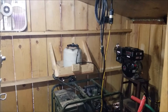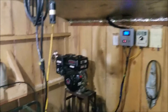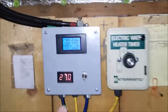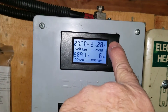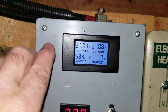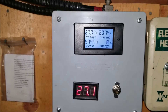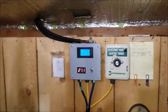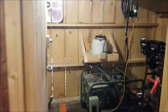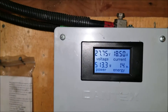I've got it started and I'm letting the engine warm up using the internal voltage regulator. We're seeing 21 amps going in — this is the actual voltage upstairs. I'll let it warm up for a few minutes and then switch it over and run it manually at 30 amps. That ought to be warm enough — currently showing 18 amps on the internal regulator.